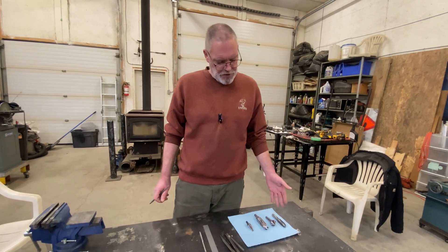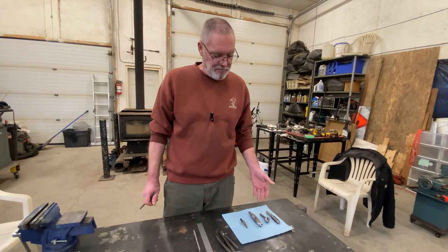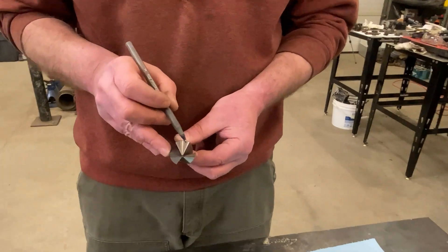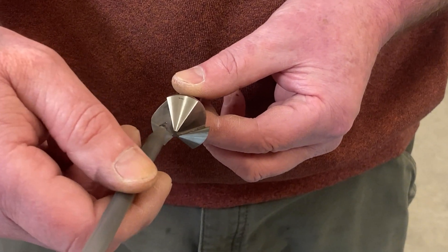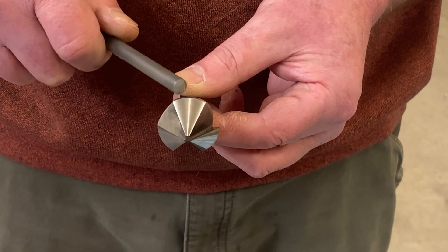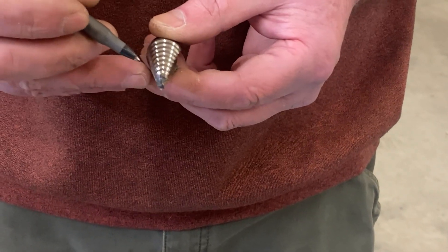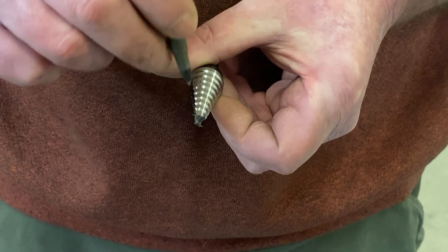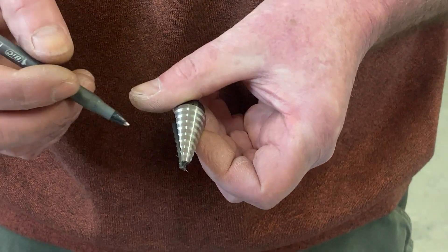I have some examples of different tools here. I've never really found any rhyme or reason to where there's an angular relief or a cammed relief, but they are more common in some areas. Let's start with this countersink, which has the progressive relief on it — it's a combination of partial radial relief and partial axial relief. I have seen countersinks with an angular relief, but in my experience the progressive relief is quite a bit more common on a countersink. I also have a step drill here, which has both an axial progressive relief and a radial progressive relief on each of its steps all the way up, and that seems to be pretty common with step drills.